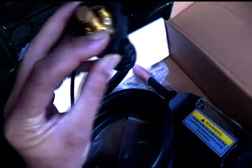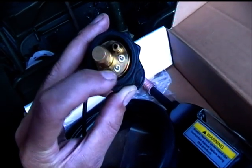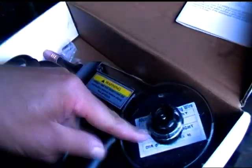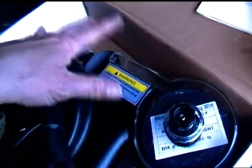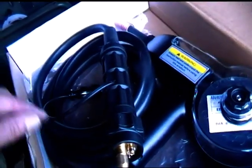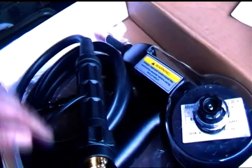So those two pins there are the switch wires or switch connections. So when you push the trigger on the gun, it will feed wire actually out the spool in the handle of the gun, or in the rear of the gun. So this saves it forcing aluminium wire up along the conventional MIG feed tube.